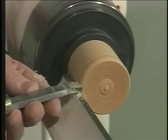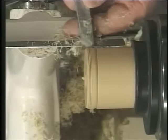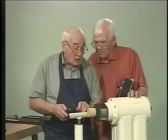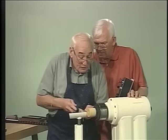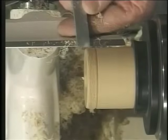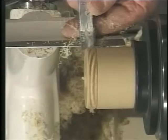Notice where the chaser is cutting. It's cutting two or three threads back. But each time I go along, I add one more thread. Now then, the threads run all the way along. So now we can start to cut with the lead tooth now, because the lead tooth has a very definite track to follow. But unless the thread is run all the way along, you mustn't cut with the lead tooth.